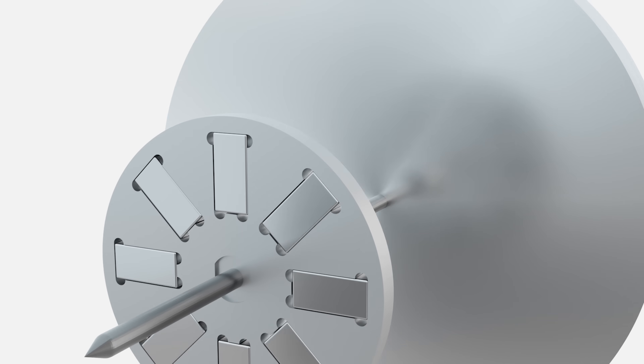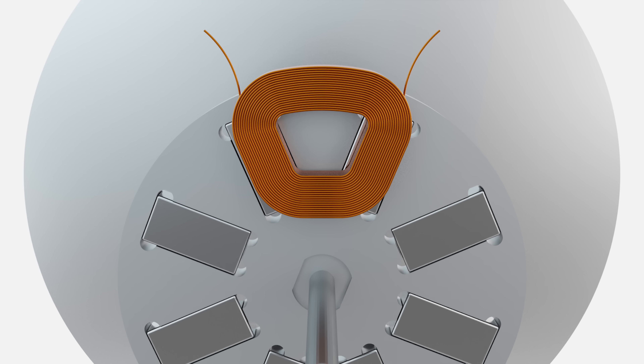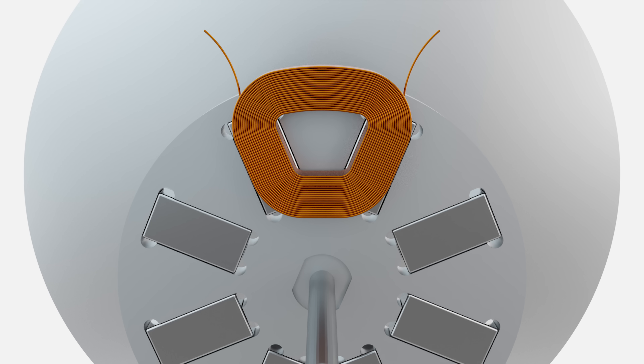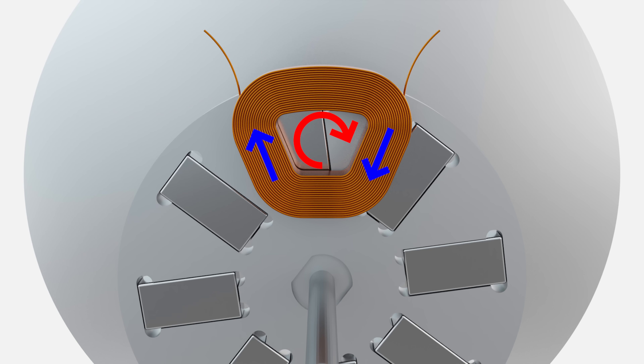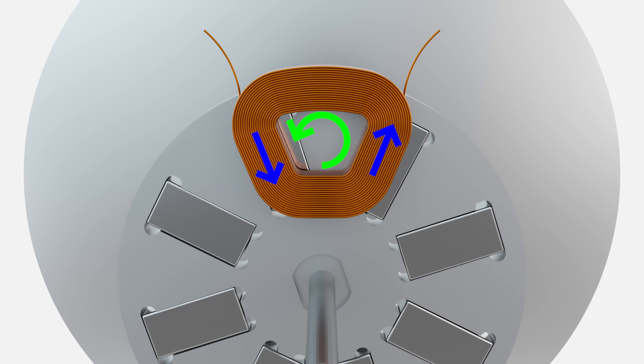To generate electricity from this I can wind a lot of wire into a coil, and as the magnetic field changes a current is induced in the coil. So if one magnet induces a current in the upwards direction, the magnet next to it would induce a current in the downwards direction because of their opposite pole orientation. This completes the clockwise current direction in the coil, and the direction of current flow will alternate as the rotor spins, creating alternating current — or AC. Therefore we have created an alternator.